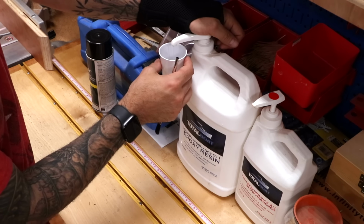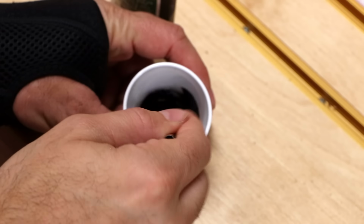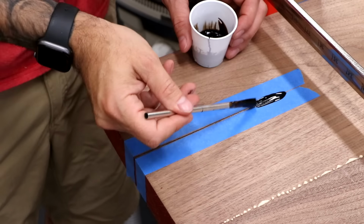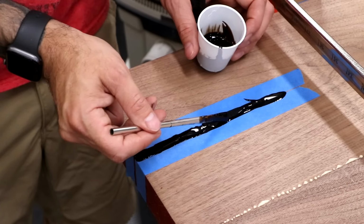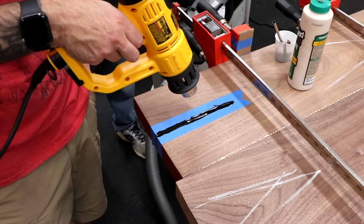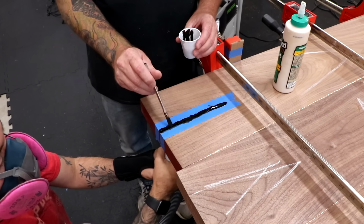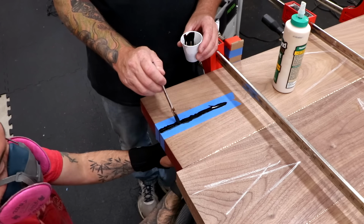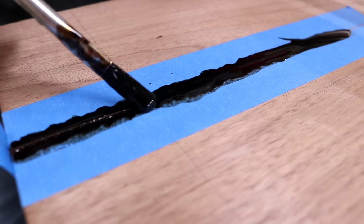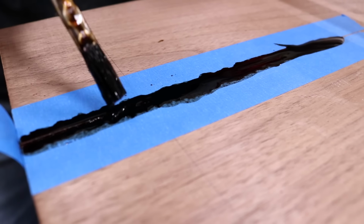We have a few cracks and knots to fill, so I'll squirt out some epoxy and add dark brown dye to it. For the crack, we'll use blue tape to reduce the amount of staining. Heating the epoxy makes it less viscous and more likely to seep down further into the crack. We can also encourage it to go deeper with a little bit of suction from underneath. And that, my friends, is my only contribution to the world of epoxy river tables.